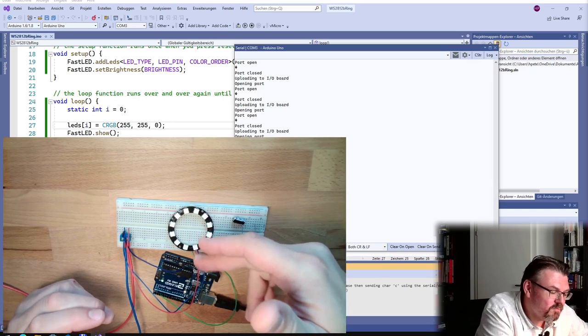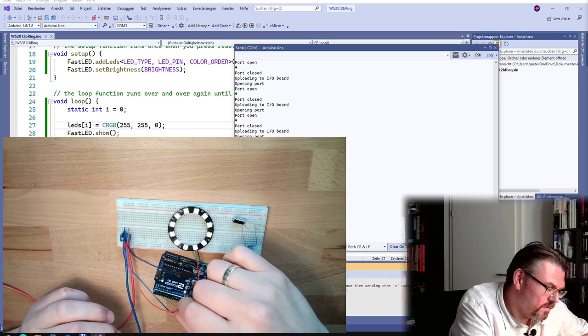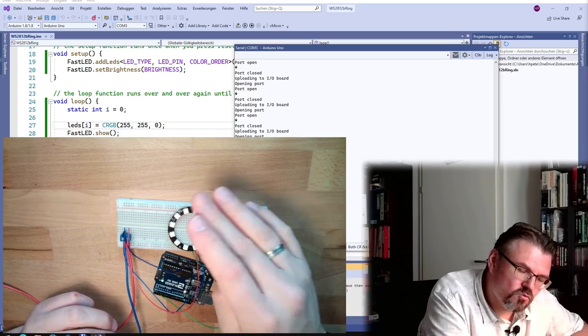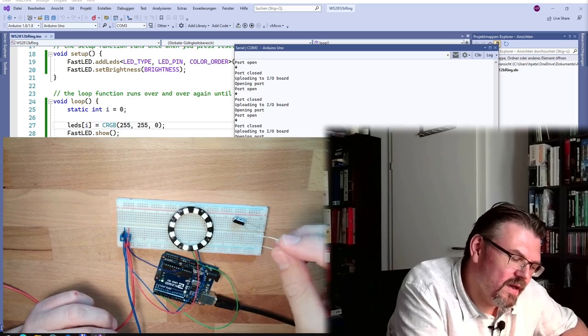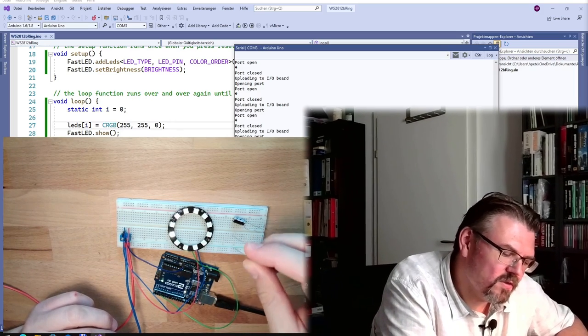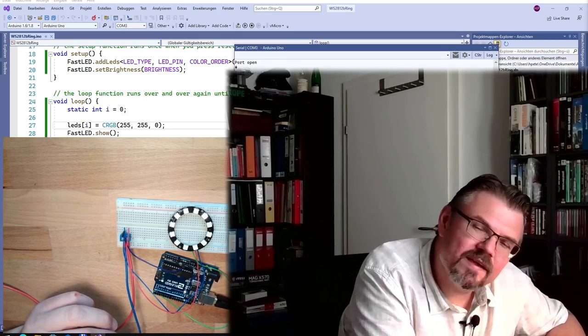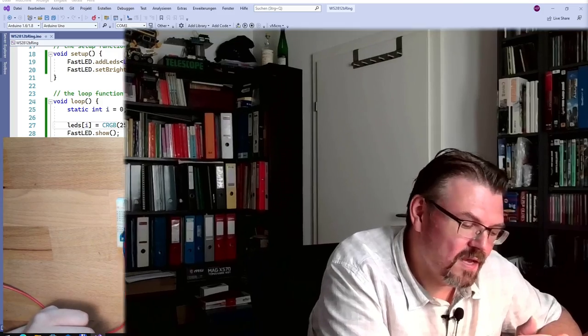But there are voltage peaks on this line, which might destroy this. So it's commonly recommended to use a resistor for damping and a resistor and a capacitor to level these peaks. I will try now to do this. Yeah? So let's switch.